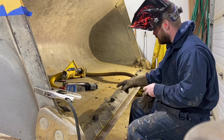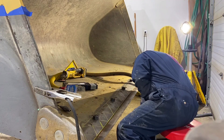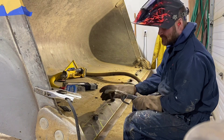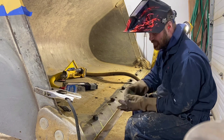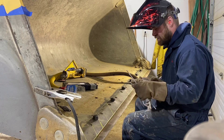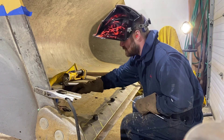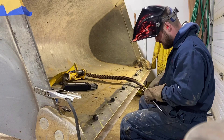I'm going to start by doing a base pass and cover it all with the hard facing. I'm not claiming to be a professional welder, but I do enjoy doing stuff that isn't structural. The idea behind doing this is the cutting edge gets very thin — too thin to bolt the replaceable cutting edge on — so you have to build it up, and then it will wear longer.